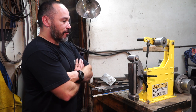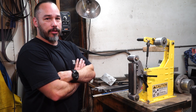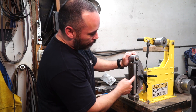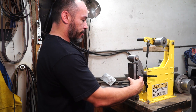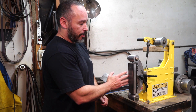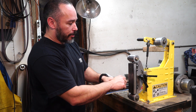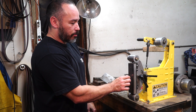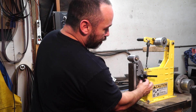For my level of hobby knife making it's been pretty awesome. I have made two upgrades — modifications I should say. I added a three-quarter inch aluminum plate behind my platen, because when you're grinding on this side you have the full range of motion, but on the other side there's a lip that sticks out like a quarter of an inch and it'll hit right there. What I did — I saw some people use a spacer — it brings it out more so it gives you more clearance to grind your knife around.